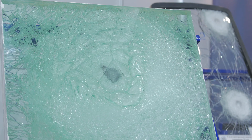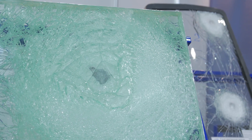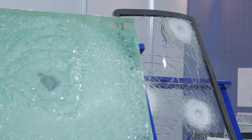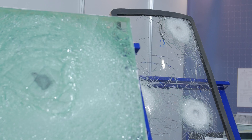So let's talk about the materials. Basically the main materials in commercially available bulletproof glass are soda lime glass and either an interlayer of PVB, TPU, some type of polyurethane, and a little bit of polycarbonate on the ends. That is basically what we'll be using in this build — some soda lime glass, some polycarbonate, and adhesive to hold it together.